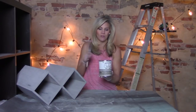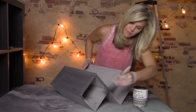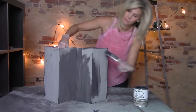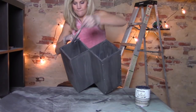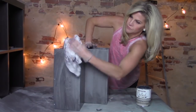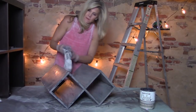I think it looks so classy. Like with all the others, you'll need to stir the glaze before you use it. Using a synthetic brush, we'll paint a thin glaze over the whole piece. I know this looks a little scary at first — it made me a little nervous too — but you'll see how it comes together. Once the piece is covered in glaze, let it sit for just a minute, then take a rag and gently wipe the excess glaze off. This is akin to the way you would stain wood. I like to swipe the rag in different directions because it leaves these cool streaks that make it look scuffed — exactly what I'm trying to achieve.